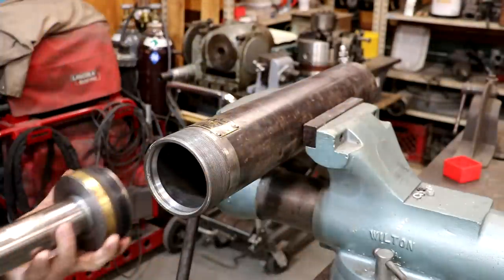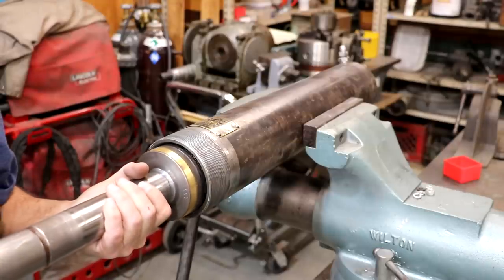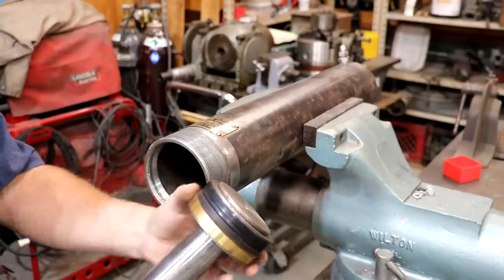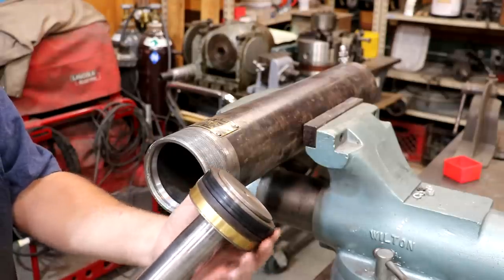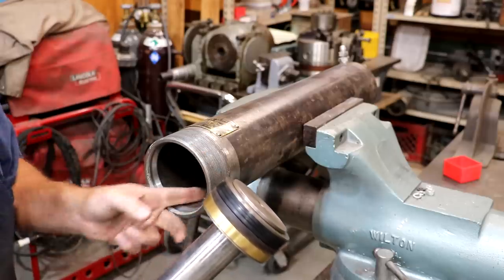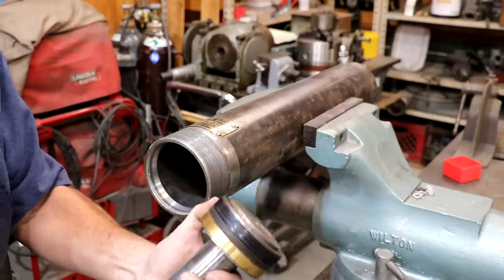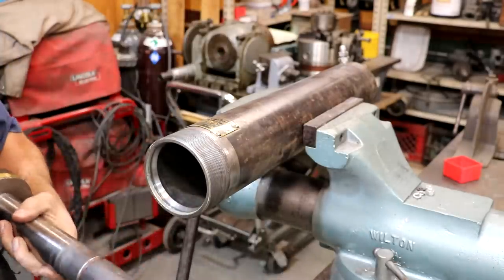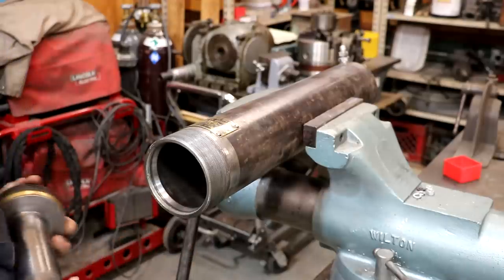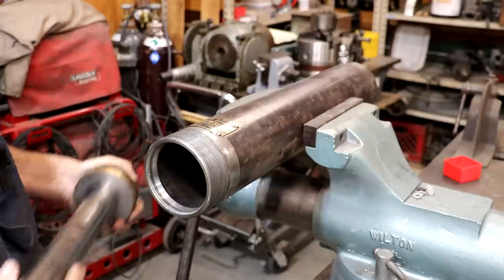This is the piston that goes up in there. Your hydraulic pressure presses against this piston and pushes the cylinder out through the bottom. I'm not going to push it in there right now because I don't have my keeper on, but that's a fairly tight fit with all your rings. I do have new rings already here in the shop. We're going to replace all these. This is the brass piece on the bottom that kind of guides in the cylinder — we're actually going to turn that off on the lathe, make a new one to make sure it's the proper size.